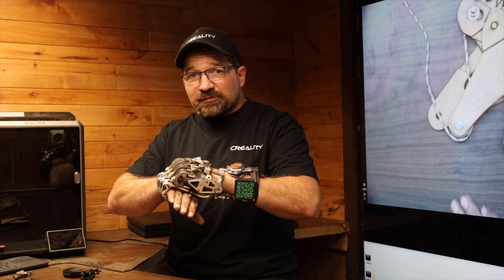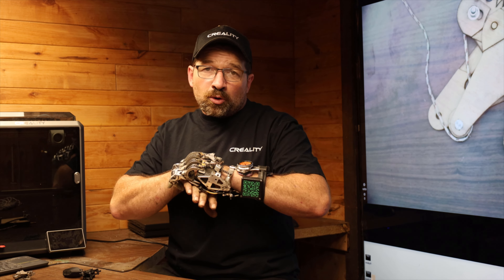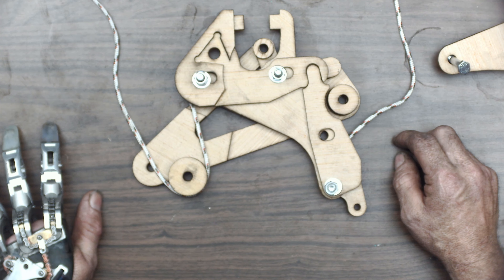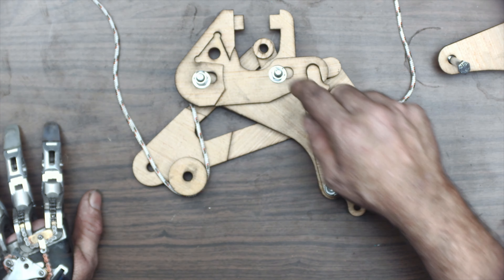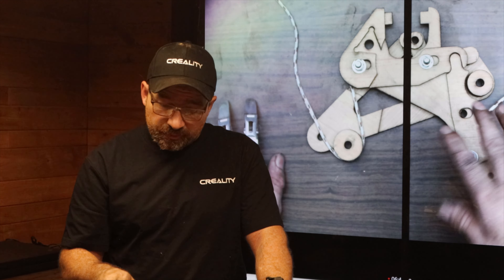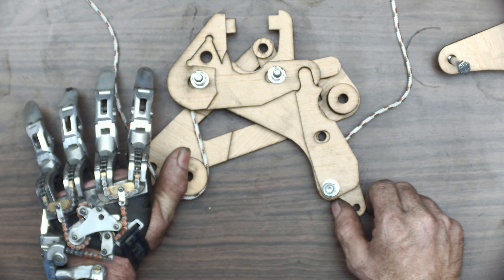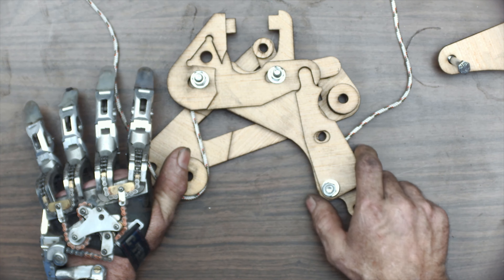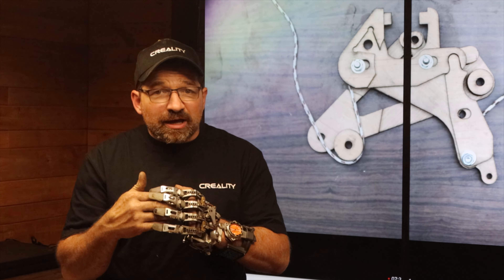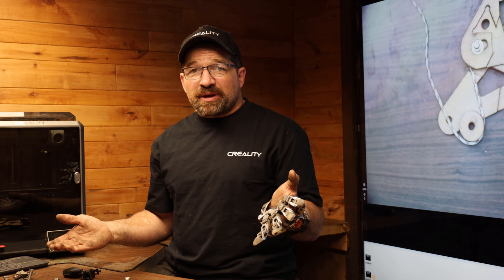So as long as there's about 10 pounds of load on the fingers, those two plates will be engaged and it won't allow them to back drive. Let's get a closer look at how that linkage works. As you can see, it's just as simple as three slots and a couple bolts to retain everything. There's a little Scotch yoke right here with only about 20 thousandths of lateral motion at this end of the mechanism, which ends up bringing both pieces of that tooling together enough to give you about 40 thousandths worth of interface, keeping the fingers from back driving.